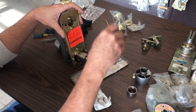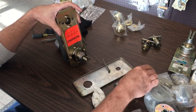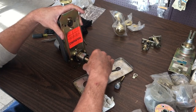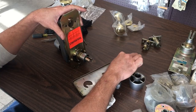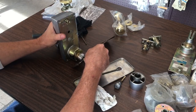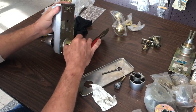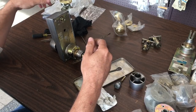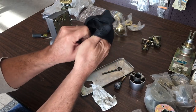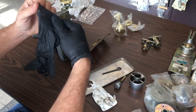This was on there like so. You've got your key cylinder and two screws and this deal. Since I couldn't get the knob off, I unscrewed this as far as it would go — only to about there — which allowed me to pop this plate off, unscrew the screws, and let this kind of fall out of the way on the door. Then I went outside, pulled it out, looked in the edge of the door, and because this was jammed I was able to reach in and shim the latch open, because this is on the door with a deadbolt as well. At night they use the deadbolt; during the day they use this.